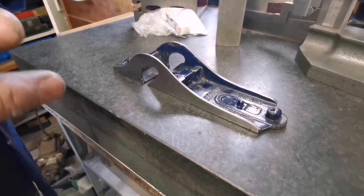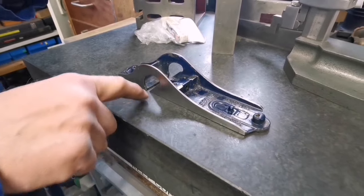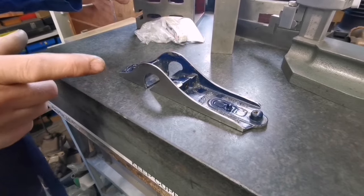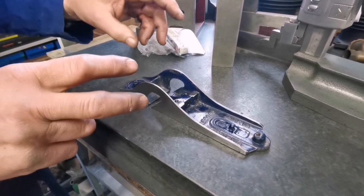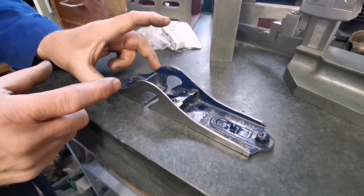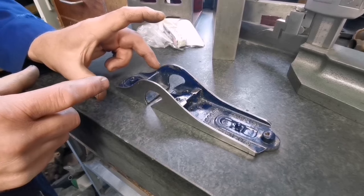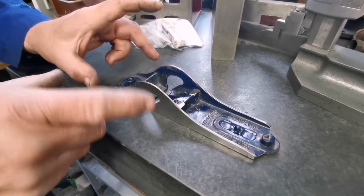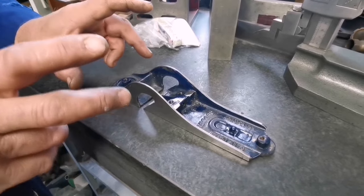We'll cramp this down to the steel as solidly and as firm as we can with a flat face and a reference edge. So this piece is unsupported. Then we're going to go in with a gas, which unfortunately will spoil the original enamel. We'll go in with the gas and we'll warm these areas here. And then the idea is to try and pull it while it's warm, pull it sideways, and then hold it with a cramp, and then just slowly play the flame over it to let the temperature down slowly,